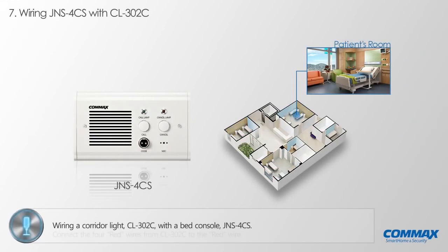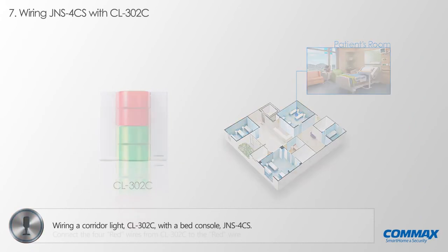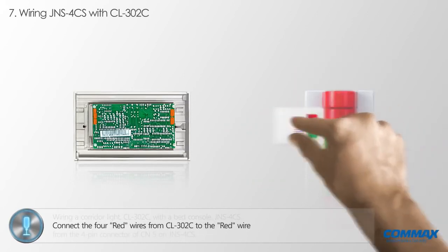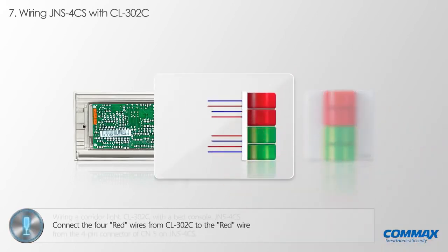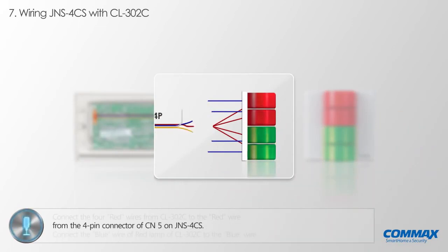We would like to show you how to connect the corridor light CL302C to a bed console JNS 4CS. First, please connect all 4 red wires from CL302C to the red wire from the 4-pin connector of CN5 on JNS 4CS.